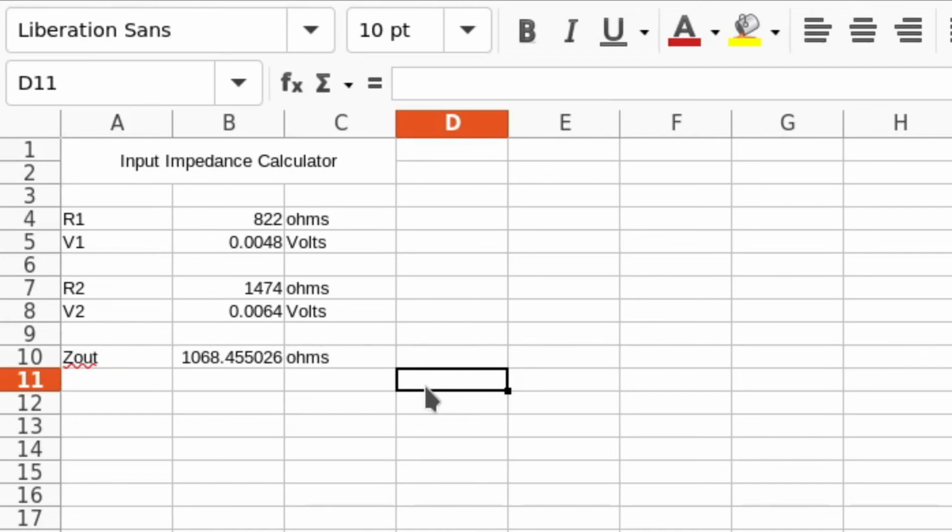Yeah, in the next video we'll be looking at measuring the input impedance of the radio we're going to connect this microphone to. So stay tuned. We will also need to know from that radio the amount of millivolts input. That will help us set the gain of our amplifier. So we need to know the input impedance of the radio audio circuit.